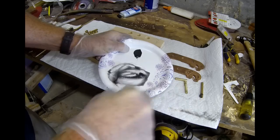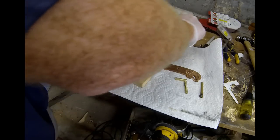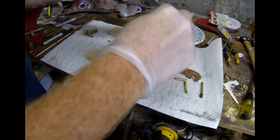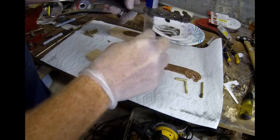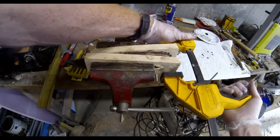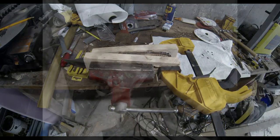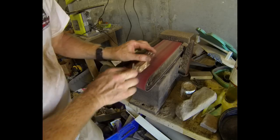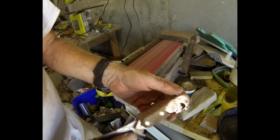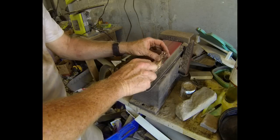The next and one of the last stages is to attach the brass dragon head liners as well as the wooden scales. I use two-part epoxy mixed with a little black paint — that's a personal preference, you could use clear epoxy if you wanted. I assemble everything with brass pins, including a mosaic pin on the handles, then clamp it all together with some wood and a vise and let it completely cure. Once out of the vise, I finish sanding down the wood handles and liners so they match perfectly to the spine of the knife, smooth out the handles, and round them over on the top and bottom.